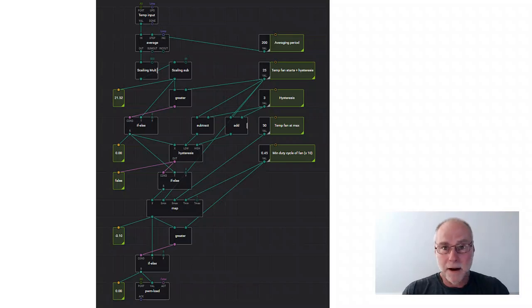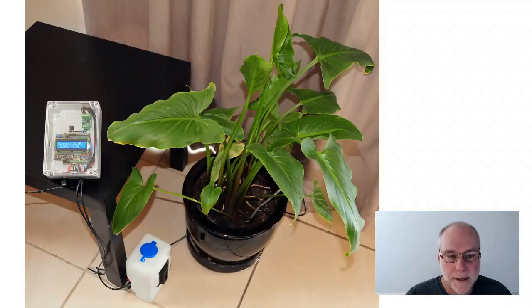Now, again, I made it from scratch. It's a XOD program. It's not very hard to do. It's very easy to modify, and it's free. And as I said earlier, with the cost of Arduinos, with the cost of MOSFET modules, a MOSFET module that could run a reasonably powerful fan costs $5 US, even less sometimes. It's just absolutely extraordinary what can be achieved with this software, just with a bit of logic, because of course the program is quite logical in its layout, and a little bit of familiarity with what those XOD boxes can actually do, what those nodes can actually do.